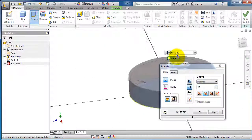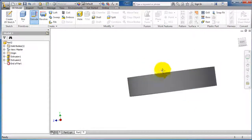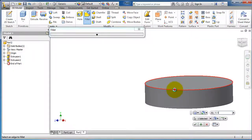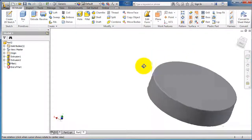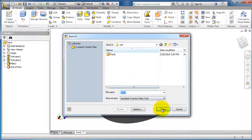It's a simple mathematical calculation — we have this 1 millimeter at the top to cover the cap. Let's make a fillet of half a millimeter. So now we have the cap and the bottom part ready for assembly. Let's save this as Part 2.